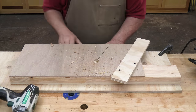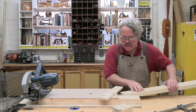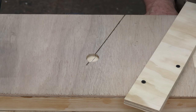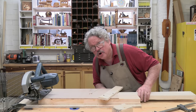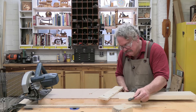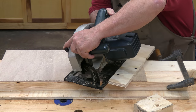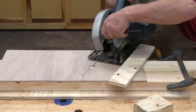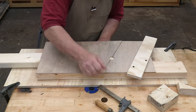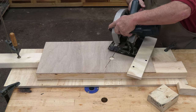This will let you see the cut marks. Mark the miters on the stock, both ends. Then slide the stock into the jig and line up the marks with the kerf that you just cut and clamp it down. Cut one end of the leg guiding the circular saw along the fence. Release the clamp, reposition the leg, and cut the other end. Note that I'm using a sacrificial two by spacer to help keep the table from sagging on some of the cuts.